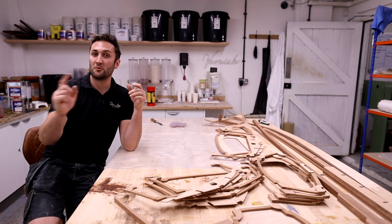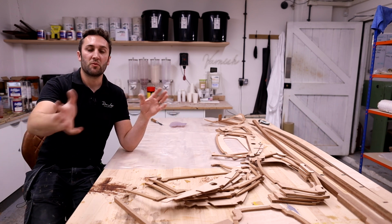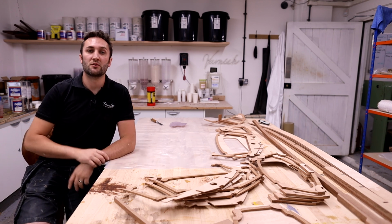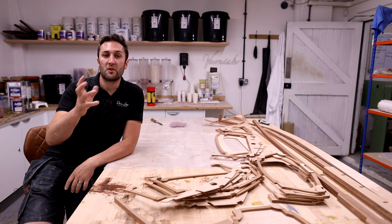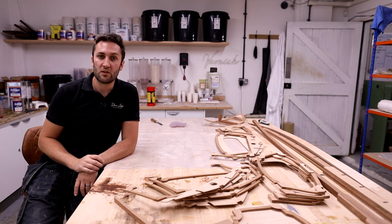I'm currently building a quarter scale version of our new boat design called Temptress, and that is what you just watched me take into pieces. So we've done a complete dry fit and put everything onto the strongback system, got everything set up and done a preliminary install, pretty much so that we can get all of those components built and then know that we have everything ready to go on the boat.